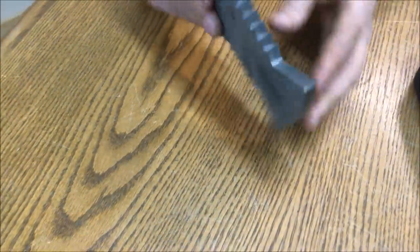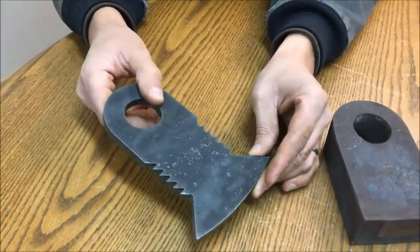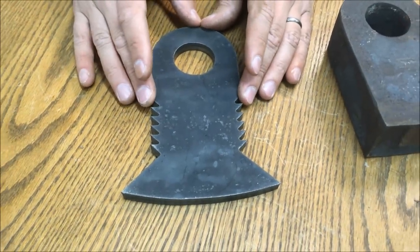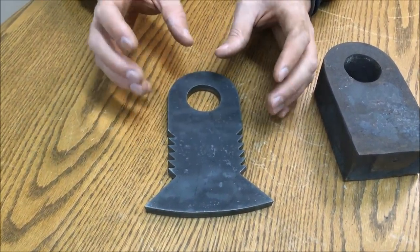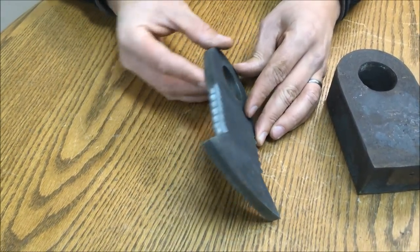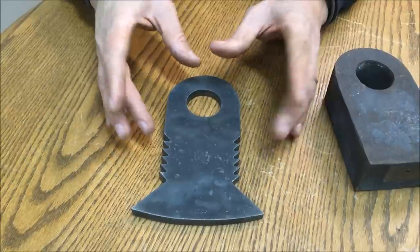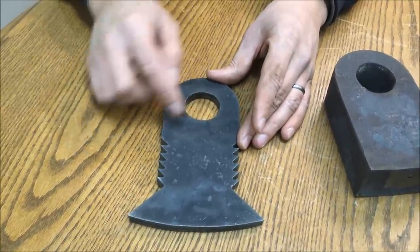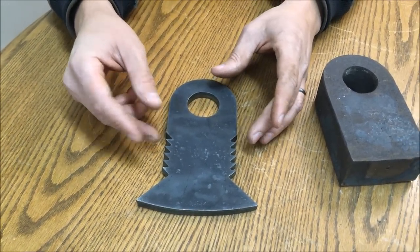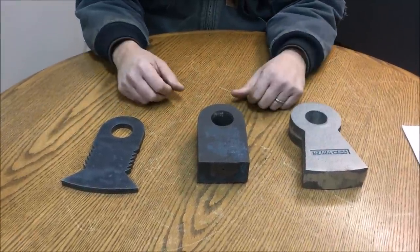This last hammer is a little bit unique. It's a blade cut from 3/8 inch AR400 — the same material we use for our armor. We found this is great for grinding up PC boards, copper wire, anything that needs a tearing or grabbing motion, anything you're trying to shred. As you saw in the mill earlier, we use two blades per one slot on the hammer mill — every spot you'd put one hammer, we actually put two of these blades. It hangs off the pin, and the length of the hammer makes it come very close to the inside of the hammer mill on the screen, which helps grind the material very fine. Those are the three different types of hammers we use, and pretty much we can use them for any application depending on what you're trying to grind up.